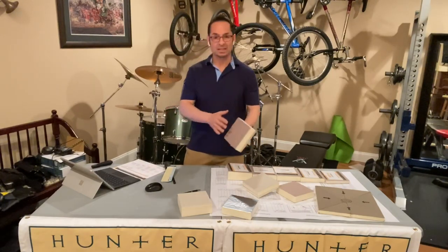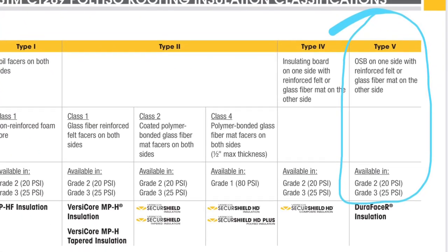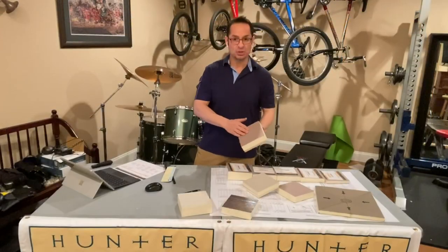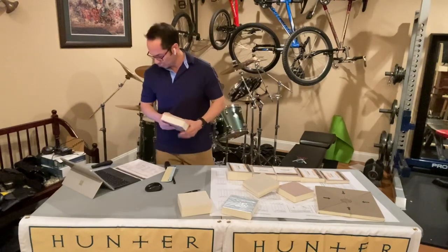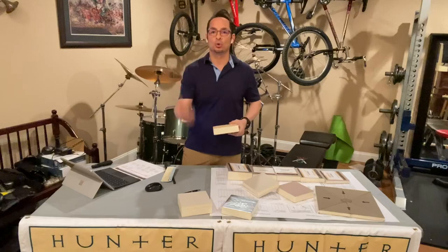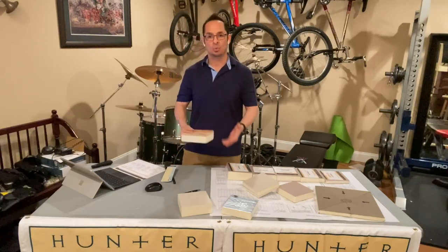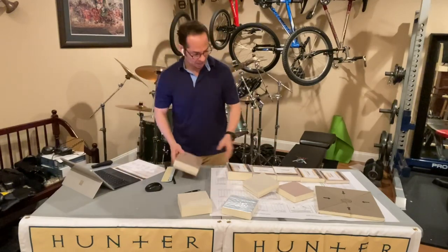This can come in class one. Remember, class is your facer. Class one is going to be your glass reinforced felt. Yes, it's available in grade two and grade three. Remember, your grades are your PSI. Grades, 20 PSI, 25 PSI. Make sure that you don't miss any of this, guys, okay?